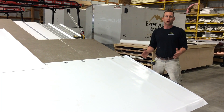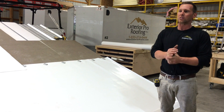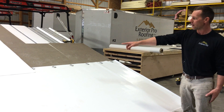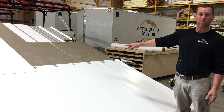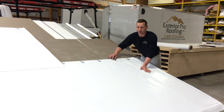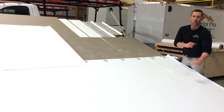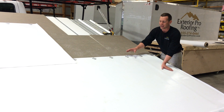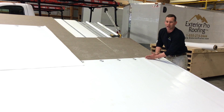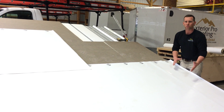Most people have a good idea about how you would glue a membrane down, but very few people have an idea about how you would screw a membrane down — that's the mechanically attached method. I've already got this particular membrane screwed down to the metal deck. If you look closely, about every 12 inches I've got a screw and a plate. This sheet is about every five feet, so for a mechanically attached system I run a row of fasteners along the edge of the sheet, and I don't have to use glue.